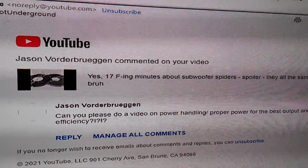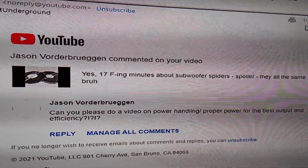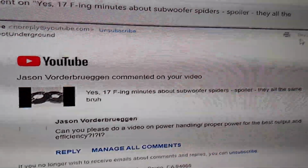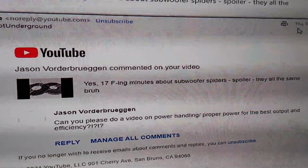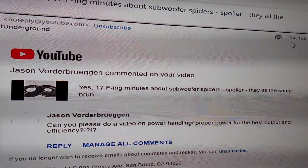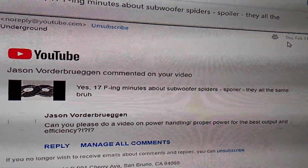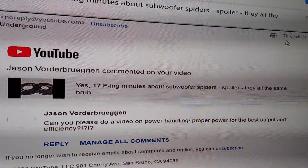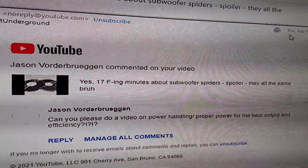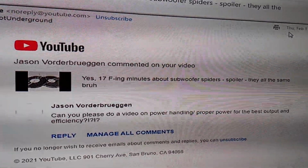Anyways, to finish Jason's question, it's about efficiency. The other video is on efficiency, but this is about proper power and best output efficiency. So again, there's always going to be a compromise. When you get close to the VAS, remember that the VAS is the minimum. I forget what the specs are, but basically it's the minimum amount of air required to reach the FS at whatever the level frequency is. I think it's probably like a 3 dB down point. And that has to do with box design and what your goals are.